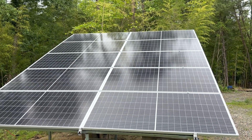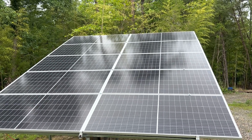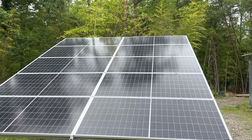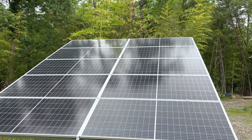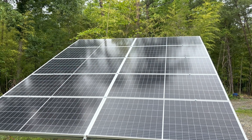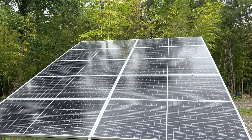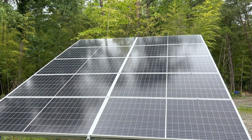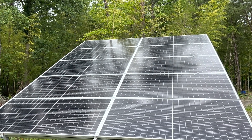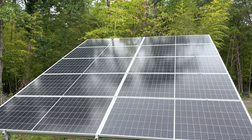Here's the second array. I combined both these strings together, so it's a string of 10. The amperage is right at almost 10 — I believe it's like 9.8 or something. Same panels, just a smaller array. These are bifacials also. So this is right at 500 volts, just shy of 500 volts, and right at 10 amps going in. This was on the third string — either way, it is the second string on the unit.